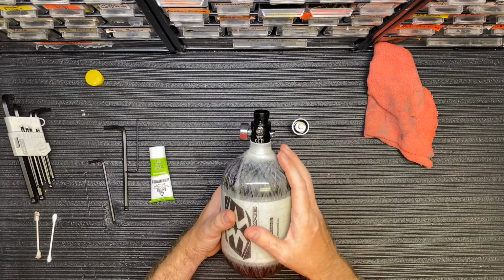So I don't recommend actually taking this apart. You don't have to take these shims off, but they do go in a certain way. So if you do pull them off, I would definitely make sure you take a picture of it beforehand. Some older models will have, I believe, more or less shims on the inside of it. So you don't really want to mess that up if yours is different than this one. And they are kind of held on by this O-ring here. So just be real careful. Make sure you keep them all together, and you don't have to basically mess with the shims if you keep them on the stack or keep them on the piston.